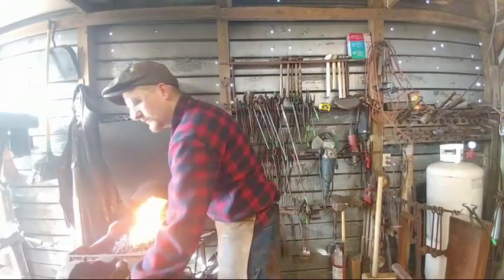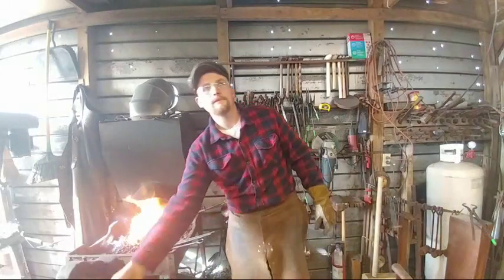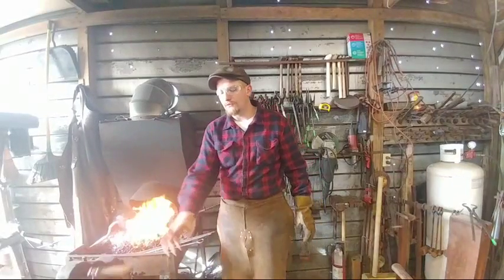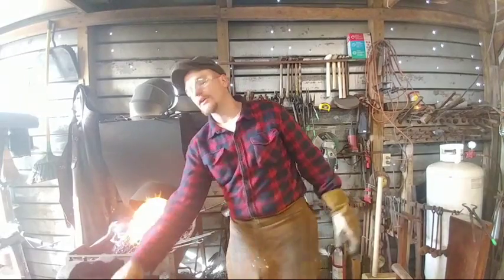Steve Stokes asks: is it okay to use a bench-top shop press, manually operated, for pressing metal when forging? It's probably okay, although it would be very slow. That would be great for very specific isolations where you need accuracy, but as far as regular forging to draw stuff out it would probably be very, very slow.